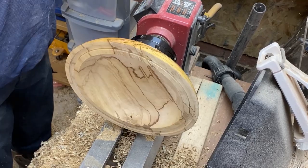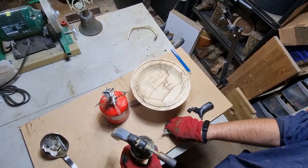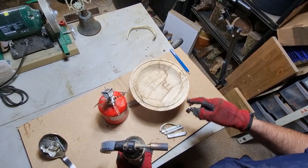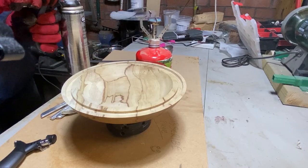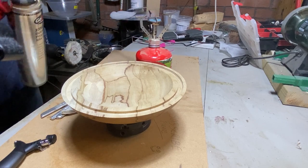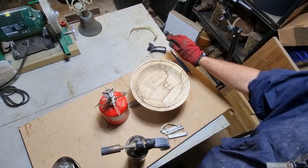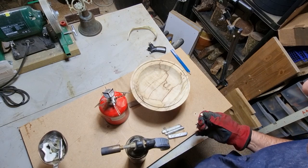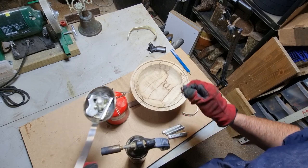I'll get set up for pouring pewter. This is how it's hopefully going to happen — I've got this perfectly flat so when I pour in the pewter it will run around the whole thing. I'm going to heat the crucible in two ways: over the flame and with a blowtorch. I'm going to take it past its normal melting point, which is around 220 degrees C, and then when I feel it's hot enough we're going to pour it — and then we start praying.